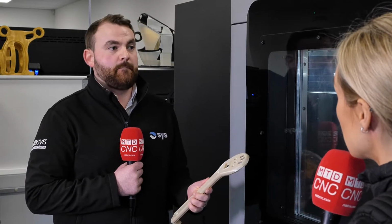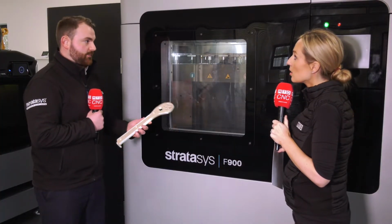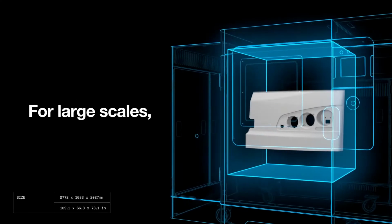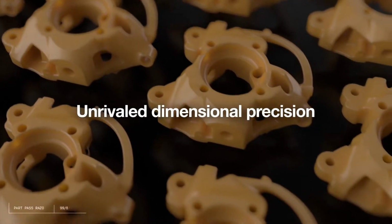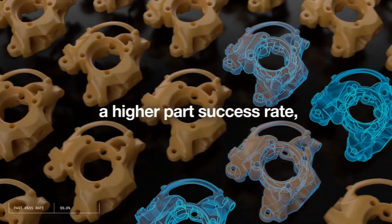That's where the benefits for aerospace come in, where it's high value, low volume production, being able to come away from expensive mold tools and being able to print parts on demand. Whether you're taking advantage of the full build envelope, and this is impressive, we're just shy of a metre cubed in terms of physical build envelope. So it can print large parts, but we can also do lots of small parts, all different geometries, where you'd otherwise have to scale up by having multiple tools.